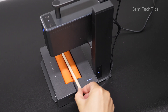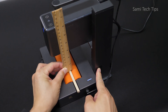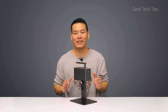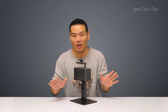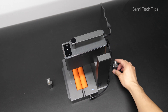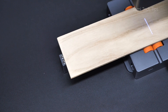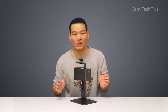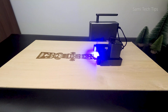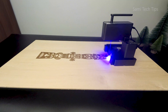If you print something cylindrical and it's impossible to use the L-shaped ranging rod, then just use a ruler to measure the distance — make sure it's 110mm. Second, when you are engraving something extra long, make sure to put the roller bearing assembly beside the standing bracket in an appropriate position, so the object won't tip off the assembly or lose its balance. Also, when using the engraver in sliding engraving mode, make sure the whole thing is in a horizontal position — don't touch or move it at all, otherwise it will cause route deviation.